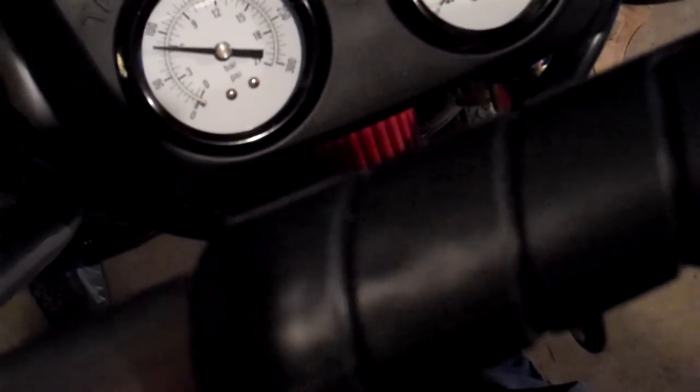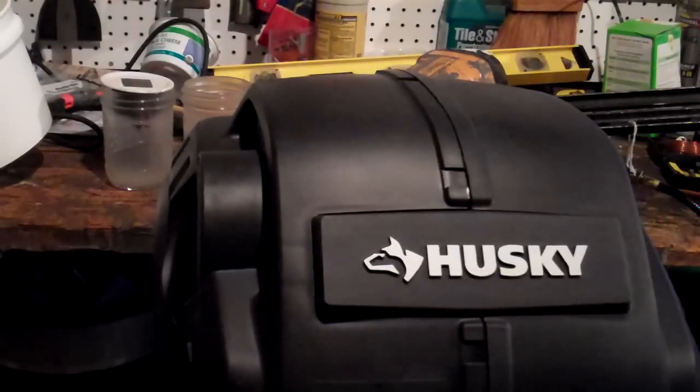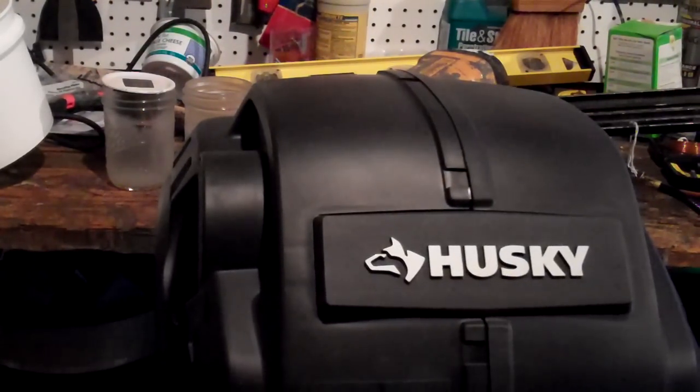Anyway, that's all I wanted to show — just the general degradation of pressure. Obviously you can get a lot of shots off with this thing if you have the tank fully filled up, but that's just the general idea of how quickly a single air nailer — and that is a framing nailer — can take down the pressure on the tank. That's all for now.